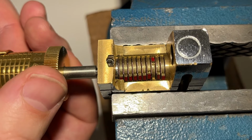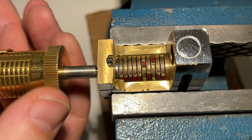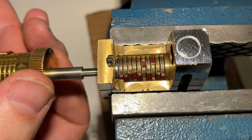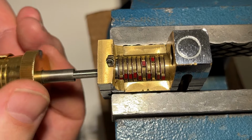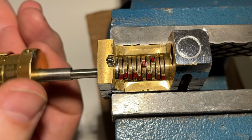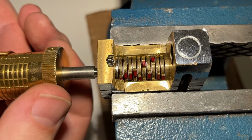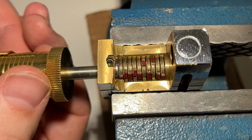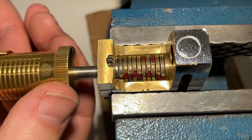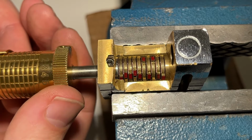The next one. No gate feeling, I leave it there. Next one. Binding. No more binding, I leave it. No gate feeling. And the first disc is set by the retensioner, I cannot move that. Then let's go. This is at some gate, then this is now binding. I move a bit. Okay, maybe it's there. This one. This is at the gate now. So this seems to be able to manage the 5-0 case.